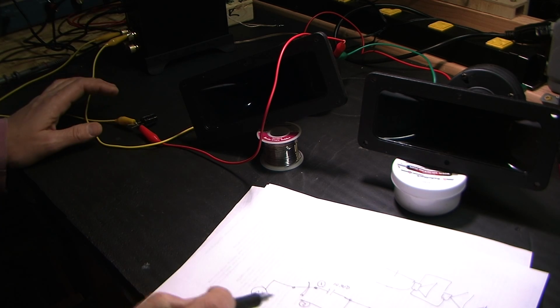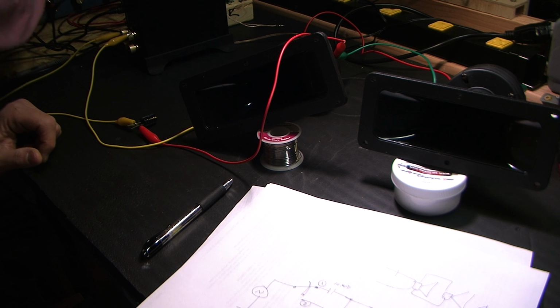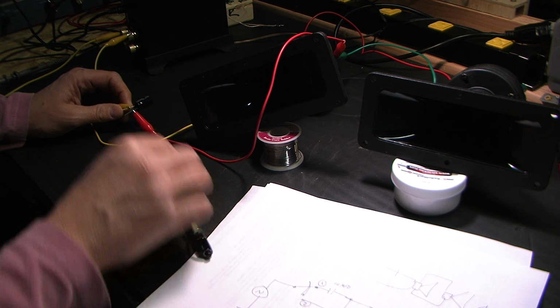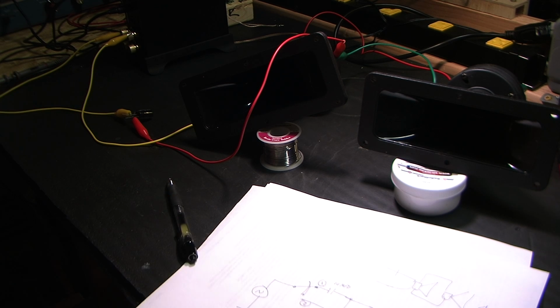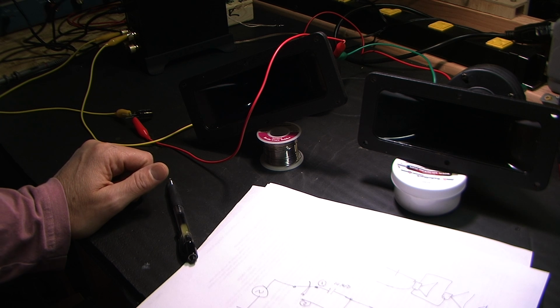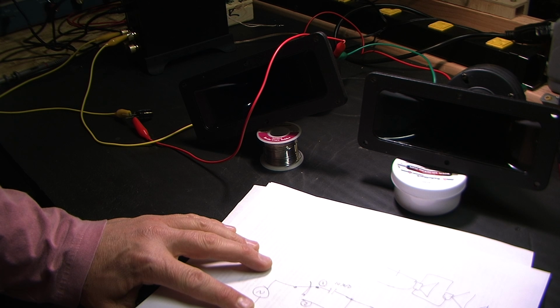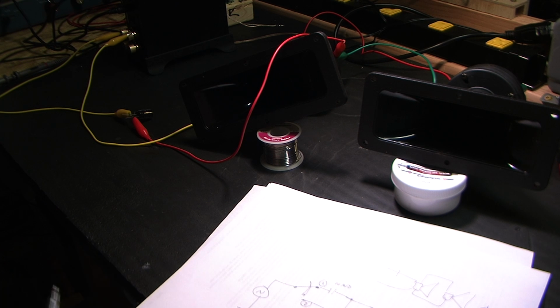The effect should be even more prominent at 1K. Okay, position 1 with the capacitor attenuating by quite a bit. 2, it should be a lot louder. It is. So that capacitor is definitely doing its job. At 10K it made little difference. We go down to 4K, and it sounds like it's attenuating to about half acoustic output just by my ear. You can't really tell by ear, but it just kind of sounds it.